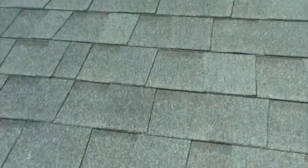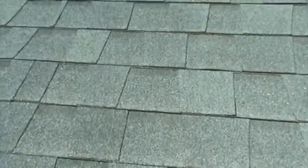But you see right there, that's what we call an open toe board hole, where when they were working on this roof, they nailed down a board so they could support themselves and do their work. And they either came back and forgot to fill that thing, or they dropped down here a little bit lower, like here, and they put an asphalt sealant in there, which will drop out anyway in a few years.